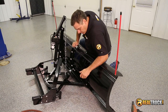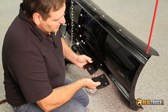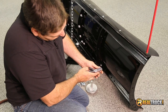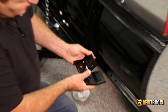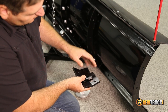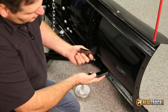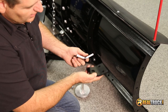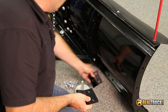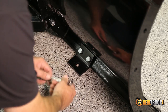The next thing we're going to do is come back here and attach our skid plates and skid feet to the back side of this blade. We're going to attach our skid shoe brackets. As you guys can see here, they're two different shapes and two different angles — that's going to depend on your vehicle and the height that your blade's going to be when it goes to the ground, because you want this thing to run level with the ground. I already know which one I'm going to need for the vehicle we're putting this on. However, if you do put one on and find it's not running even, you can always take it back off — just two bolts — and put the other one on. Not a big deal. So let's go ahead and put these on.